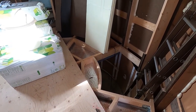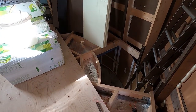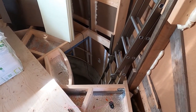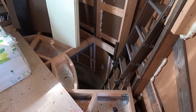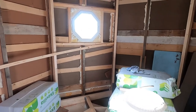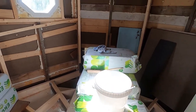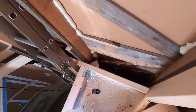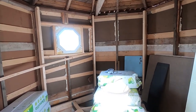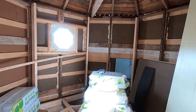The floor is based for an octagonal shape which naturally takes a lot more time. I put a little bit of foam insulation with reflective aluminum on both sides so that the cold actually stays down in the wine cellar part and doesn't come up. These bales here are insulation — I just need to put some stuff in a bucket, use a drill to fluff it up, and then pour it through the various holes so I can get the insulation done efficiently.